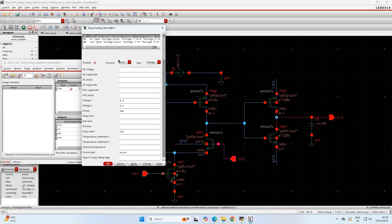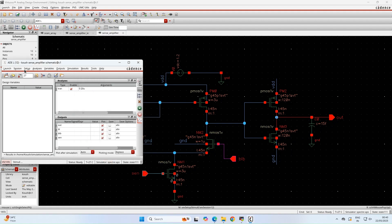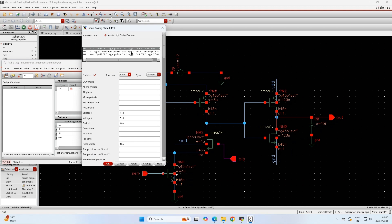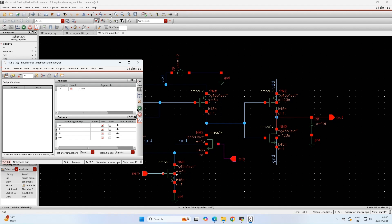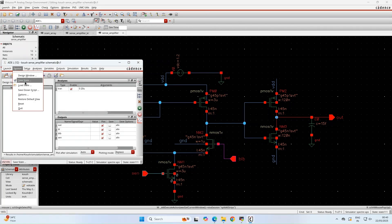In the second case, the bit line is at a lower voltage compared to bit line bar — bit line at 0.6 V and bit line bar at 0.8 V. Again there is a 200 mV difference, but now the bit line is at the lower voltage. The sense amplifier also works like a simple comparator, comparing the voltages of bit line and bit line bar. In this case the output goes to 1.2 V — a 200 mV difference between bit line bar and bit line is converted to a logic high output of 1.2 V.